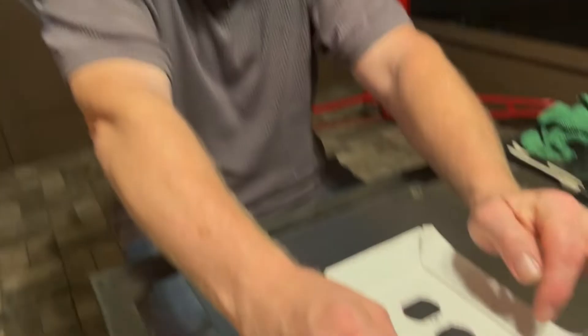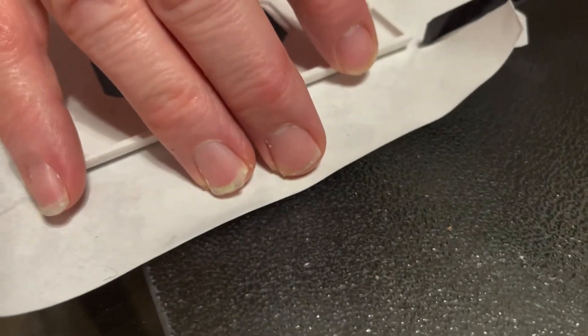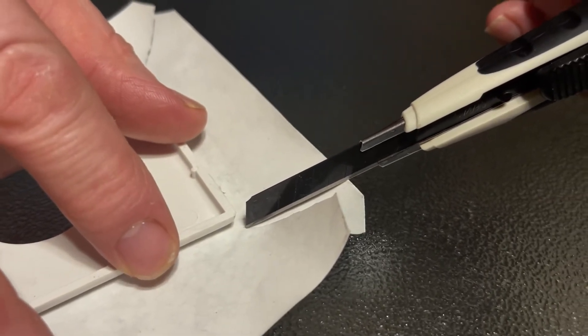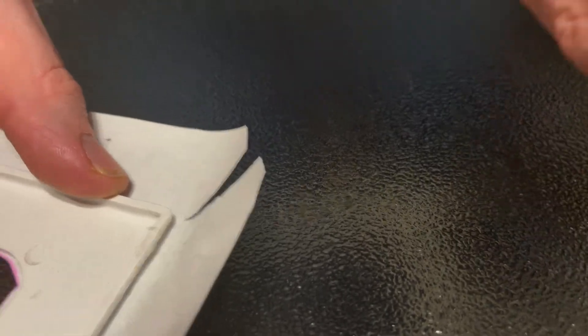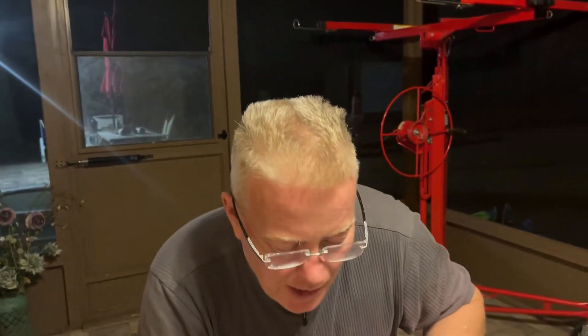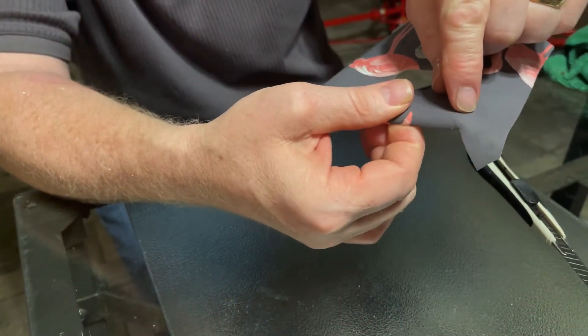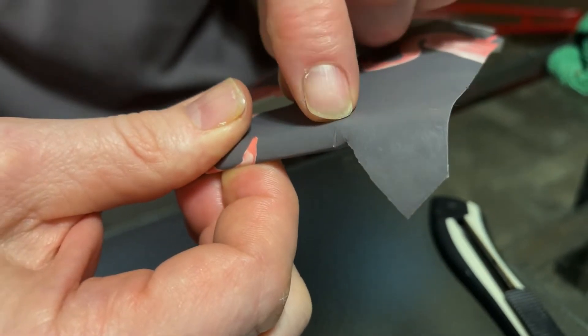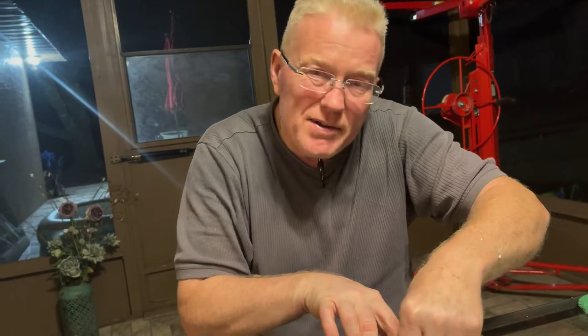The only other thing to get this secure is to fold it properly. This is where you can make it very sloppy if you don't do it right. What I've done is I've made four cuts in the wallpaper right at the corners, but I didn't do it directly under each corner — I did it three sixteenths of an inch away. On each one I made my cut away from the corner, because if I don't, when I fold it over you're going to see the corner. So the wallpaper needs not to be cut in order to cover the very edge of the switch plate cover — now it's like wrapping a present.